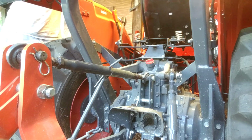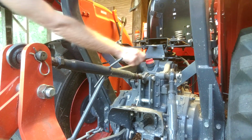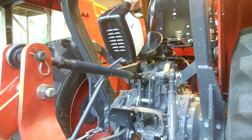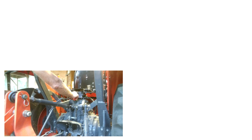So let's pop the driver's seat, and on the back is an obvious red input for the hydraulic oil that literally says oil. Using a funnel, gradually fill it. Go back and check the sight tube, and then you've done your tractor good. She is a happy tractor. After screwing the red oil cap back on, clean any messes. And for your funnel, I usually use Brake Clean, brake parts cleaner, to clean it for future use.